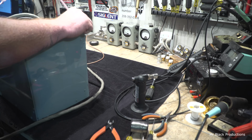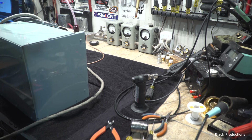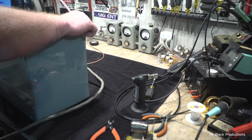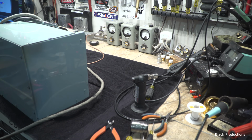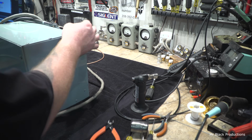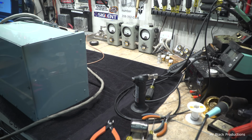That, and guys have a tendency to forget that there's sheer death on the other side of this plug. I mean, literal instant death. And so when they're back there checking all their plug connections on the back side of these two-piece amplifiers, they automatically reach over and grab that high voltage connector, not knowing that millimeters away, or one little crack in the Bakelite plastic, is death.